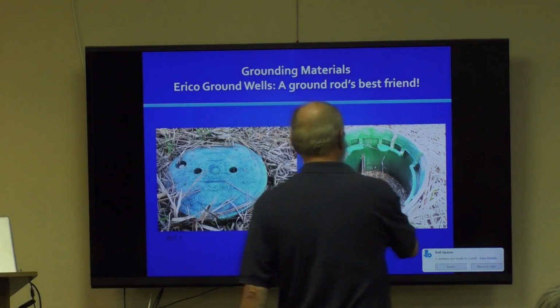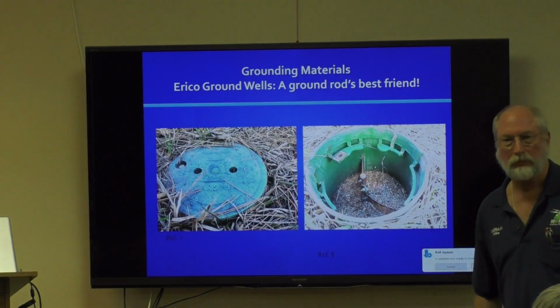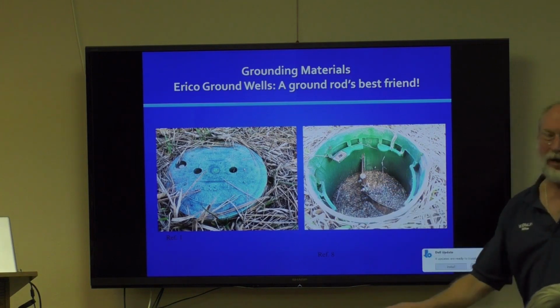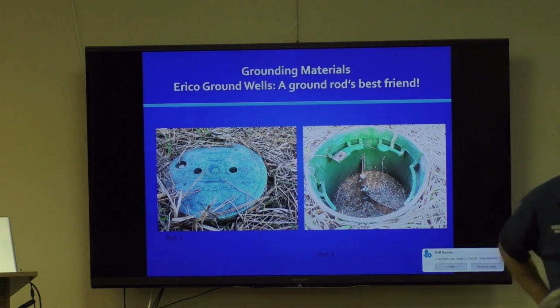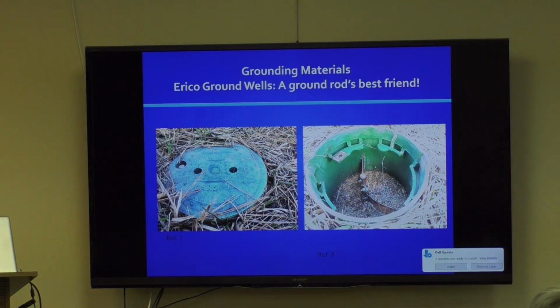You take a look at it. You're not going to be able to inspect that whole 8 foot length. This connection will last way longer than one that's sitting in earth and subject to moisture and bugs and, I mean, everything rots in the ground. So to answer the question, what he's inspecting is the ground strap to the ground rod connection. Yeah, the connection.